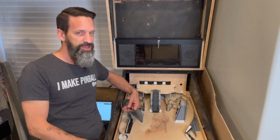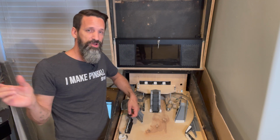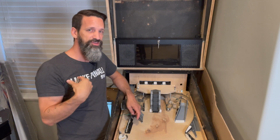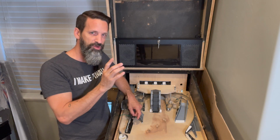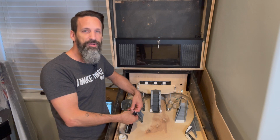You need to declare how you're going to be homing or resetting your stepper motor. So there's a homing mode. You can do either hardware or switch. We're using switch. I'm not super familiar with exactly how hardware works, so we're not going to talk on that one right now. But I think this is probably one of the most common ways people go about this.